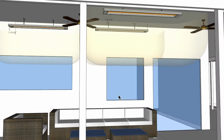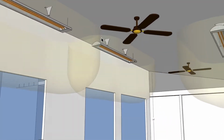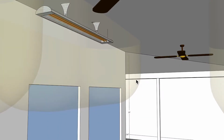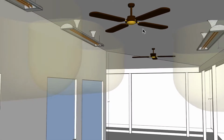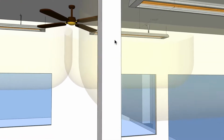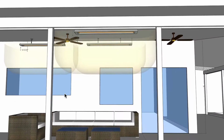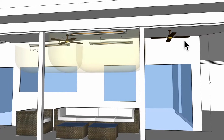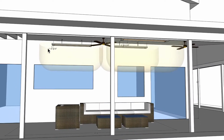can actually handle. Now going back to the clearances here, with the 4-foot diameter fan, we want to make sure that the blade isn't going to get impeded with the clearance there and there. That's why that 4-foot diameter is important. And also, if it's not 4 foot, then we need to possibly spread the units out further right and left. I have them, these two here, centered within this span here. And we have some room to move to the right here. If there is an issue with that, then we can obviously move the one to the left here.